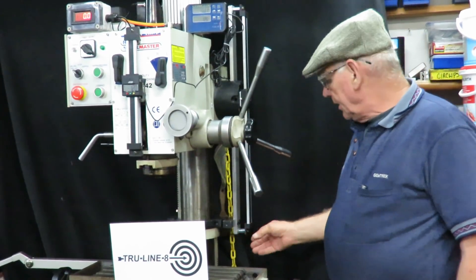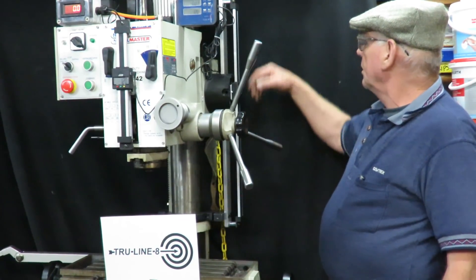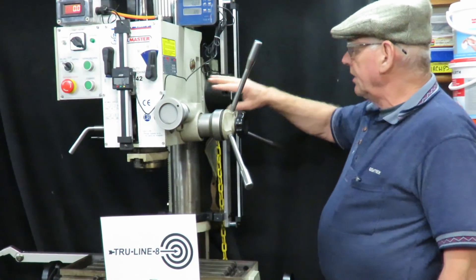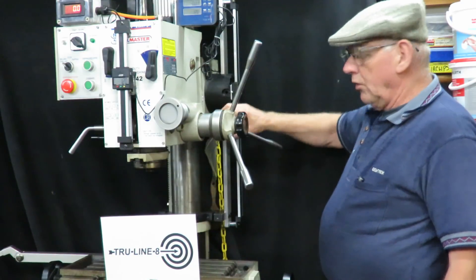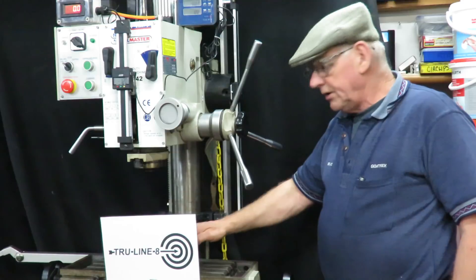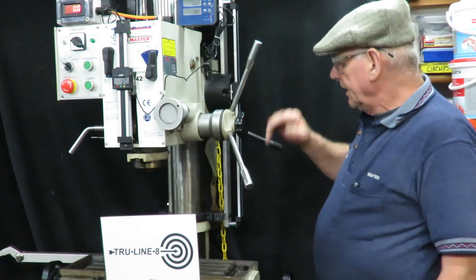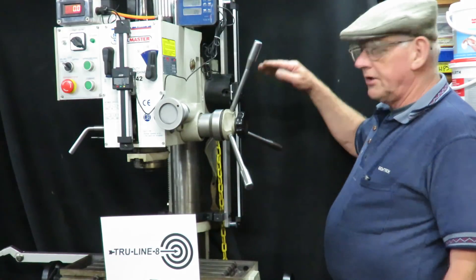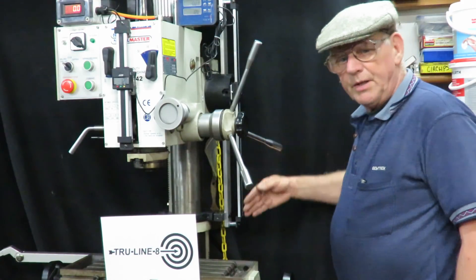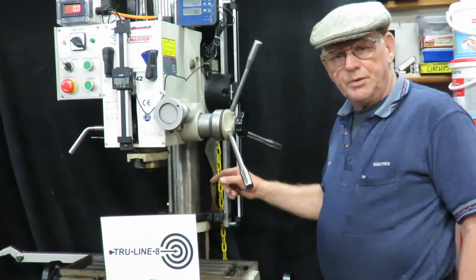A secondary item that came out of this was the ability to mount a DRO on the kit, so we can actually measure and set the heights we want. If you want to set down at a particular height, you zero that in, then take it up to a new height, bring it back down to that zero again, and you know you're in line — you've got repeatability.